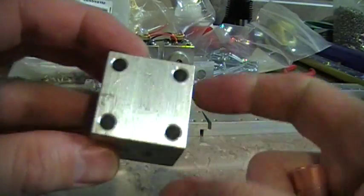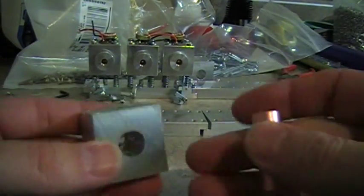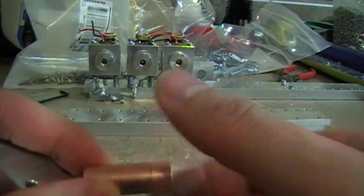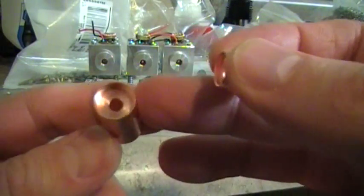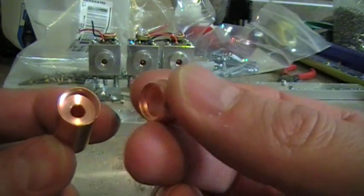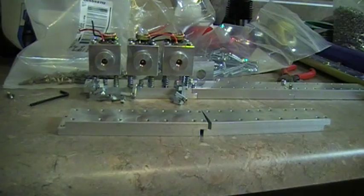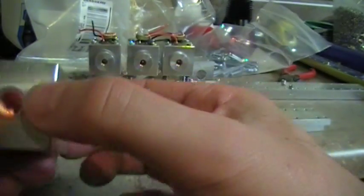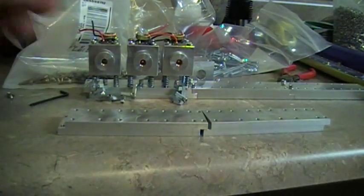Here's a close-up look at one of the cubes. It's got a little set point. Here's the module — it's solid copper; the back part helps heat sink the diode. This is for the nine-millimeter. Some of these are hollow; this is the good one. They're not cheap like the little annex modules — a real good fit. I always use Arctic Silver to help transfer the heat.